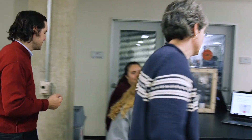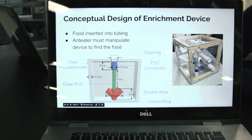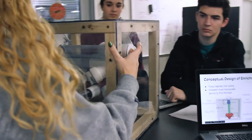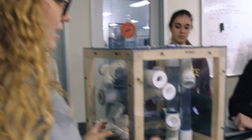We were assigned to make an enrichment device for the anteaters at the Houston Zoo. They want something that makes the anteaters more active. The zookeeper will put a certain amount of food in and then rotate the device to fill up the other tubes. When the device is given to the anteater, the anteater can manipulate it by turning it or climbing on top of it in order to find which of the tubes have food and eat out of it in that manner.